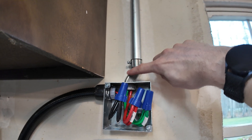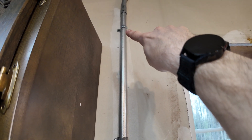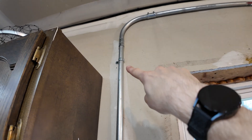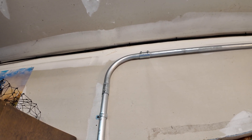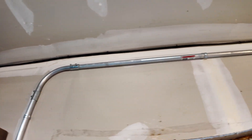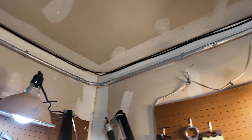From there I used the screw-type EMT — there are other types. Cut the tubing, strapped it. You're supposed to strap it within three feet of a junction box. I bought 90-degree bends instead of using the bending tool because it's kind of like an Erector set — it just makes it easier to pull out if you need to make a change. From there we just cruised along the ceiling, cutting tubes to length, putting the 90s in, strapping them on.